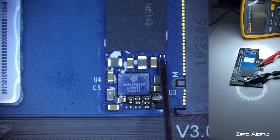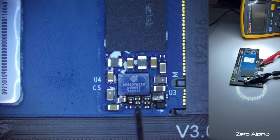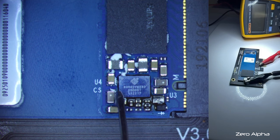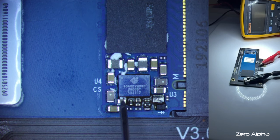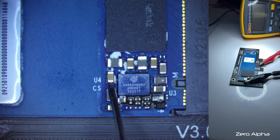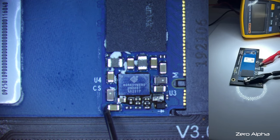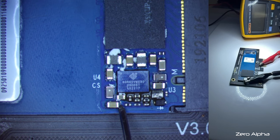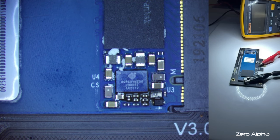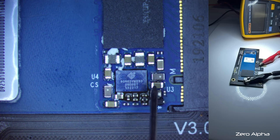We'll just touch all these caps. Now this little power management chip, it might be unique for Western Digital, who owns SanDisk, I think. I had a bit of a dig online to see if there's a data sheet. When you can't see a data sheet, it's probably not a standard off-the-shelf item. So the standard ones are good, because you can find little data sheets, gives you all the pinouts and modes, what's meant to be happening. So what's that doing there? Nothing. Interesting. So it makes it a bit hard.